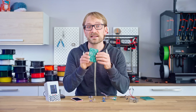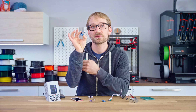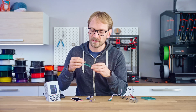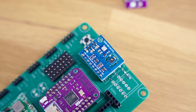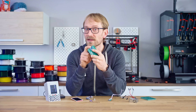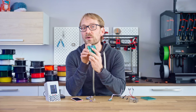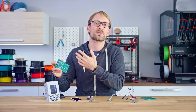The PCB also has a couple of optional headers on the side for more specialized sensors. There's a header for connecting a modified MQ7 carbon monoxide sensor, which can be useful for monitoring open fireplaces or gas furnaces, but isn't really useful for 3D printing — maybe for laser cutting. You can also plug in an ENS160 VOC sensor, which is a low-cost sensor that doesn't always produce repeatable VOC measurements, so when I used it, I had two of them plus another type to verify. These usually come with another AHT20 temperature and humidity sensor on the same board, but the readings from that are not very useful because the ENS160 tends to heat up the entire board. But the ENS160 has one quite useful feature: it's very cheap, and it reports an approximate CO2 level based on its reading, similar to what the SGP30 does.